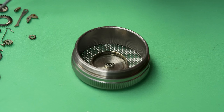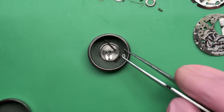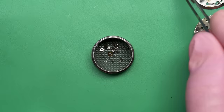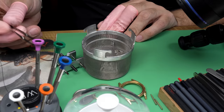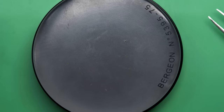Now from a big picture perspective, we're going to completely disassemble this watch — which we just did — and put everything in these little mesh baskets into the watch cleaning machine. That will allow us to thoroughly clean this movement with specialized solutions made exactly for that purpose. They'll dissolve any dirt, grime, and dried-up oil on there and get this movement back into good shape.